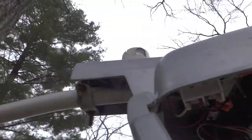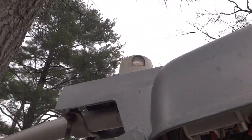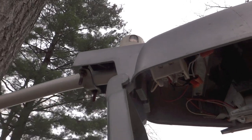There's a photocell, but that photocell is day burning, plus the little screen on it is pulled over the photocell, so it's on all the time.